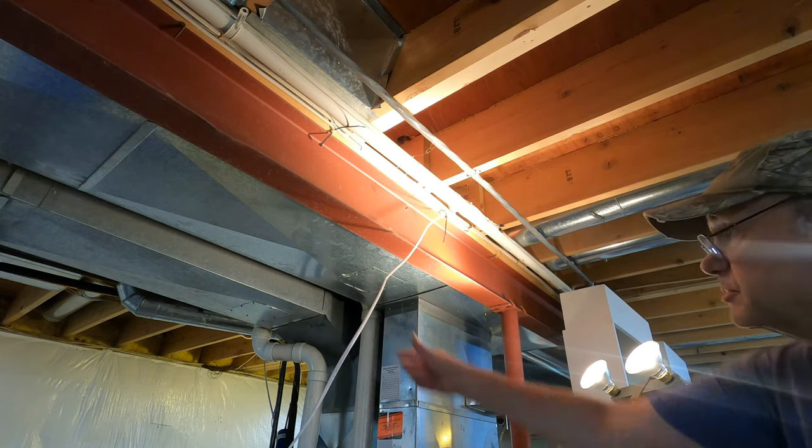So the common wire, this is for the coil input now. The common wire is white and yellow, and the 120 volt AC is white and black. So looking for white and yellow. Well, there's white and black. This looks like white and yellow here. Yep. White and yellow, white and black. So these go to my EAC output and neutral. So my neutral is here.